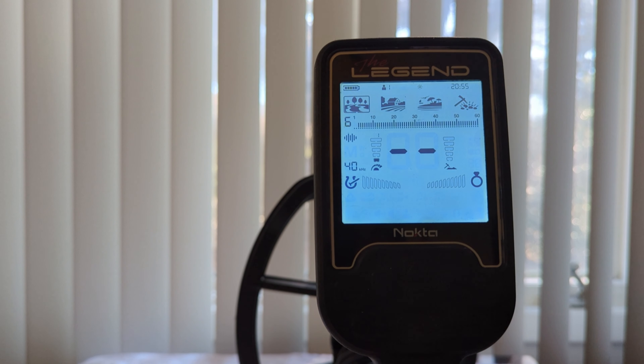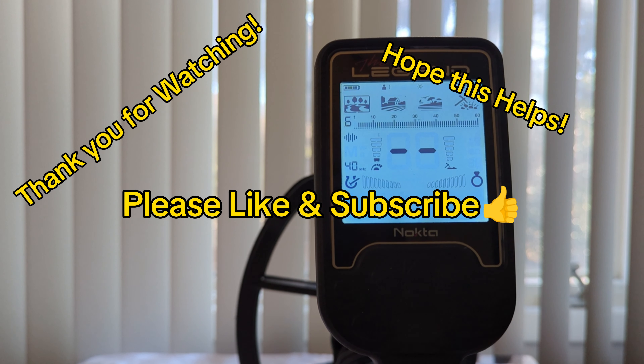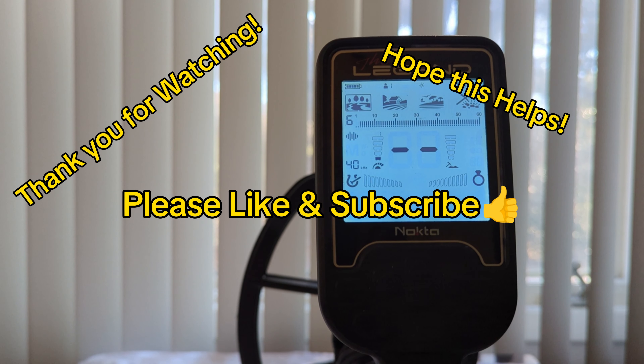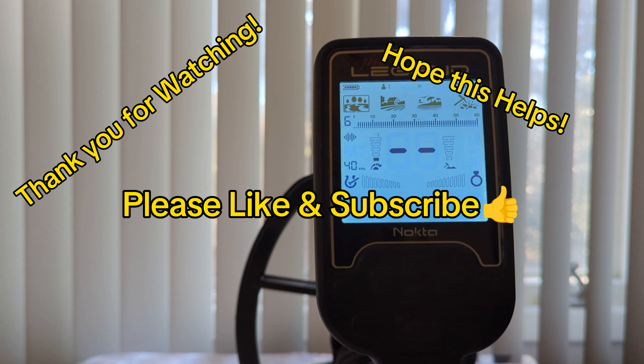My two cents at the end: I would highly recommend changing your frequency dependent upon your target type. Don't limit yourself to one frequency, because you could be missing out on valuables, precious items, or relics in the ground. One thing I've been doing lately is going over sites I've previously hammered in single frequency on my Simplex, which operates at 12 kHz, and going through them in all different frequency modes. I've actually been pulling more targets in areas I've beaten on over the course of a year. So always recommended — just change that frequency. That's frequencies, folks. Hope you enjoyed the watch. See you on the next one.